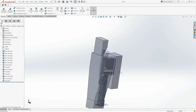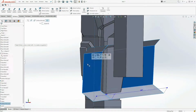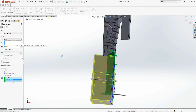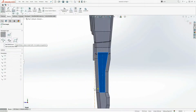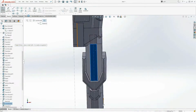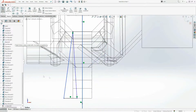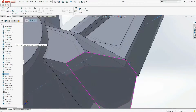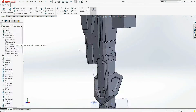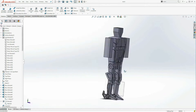Because it's going to be pretty much symmetrical, as most mechanical objects are, I only modeled half of it. This allowed the modeling time to be halved, so I don't have to do things twice. If I wanted anything asymmetric, I would add that in after mirroring the entire body. As I was modeling this, I did consider making it mechanical and moving, so I added some basic joints. Only once I was ready to 3D print did I then add in the actual joints.